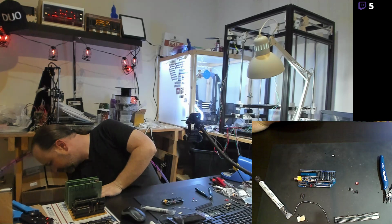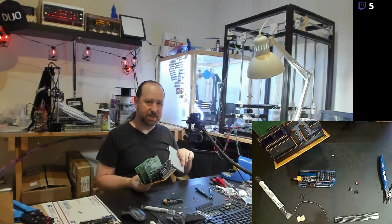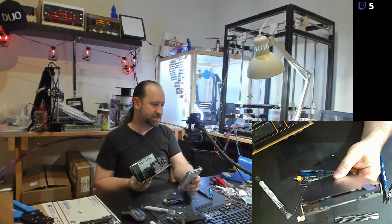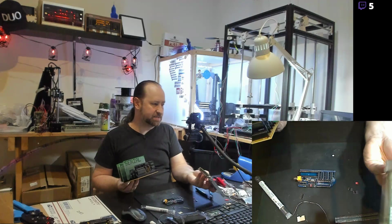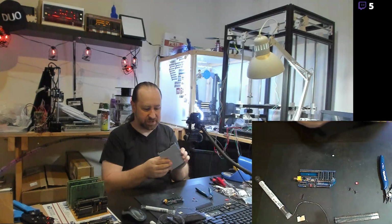Oh yeah. In fact, for this 8-bit computer, one of the expansion boards that I have kit pieces for is actually an expansion board for this. This is a floppy drive, just a standard 3.5-inch floppy drive. And it provides a standard Western Digital 8-bit floppy controller on a card, so I can actually mount standard floppy disks and run those with the CP/M operating system.